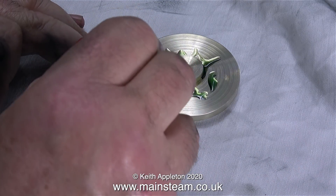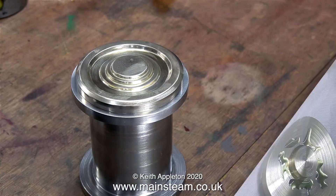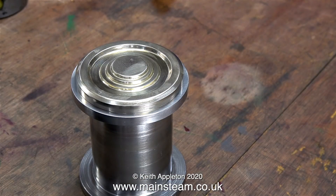To fit the cap in place, I'm going to use some Loctite 603. I've smeared quite a lot on the pulley itself, pushed the cap in place and held it firmly for a minute or two, and now it's a permanent fixture. To remove the brass cap from the pulley would be a simple job — I would heat it with my blowtorch to break down the Loctite adhesive. By heat it, I don't mean heat it to red; you just have to get it hot.